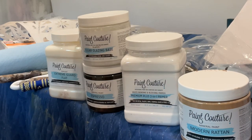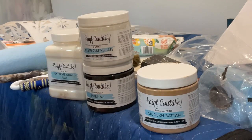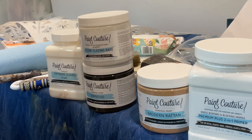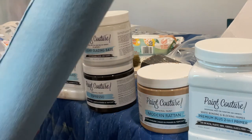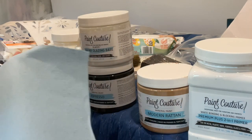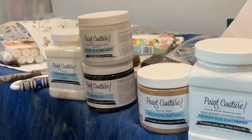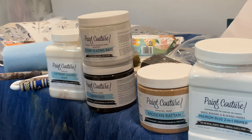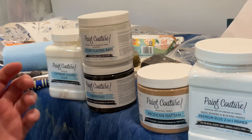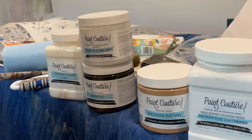I want to make sure you have all the tools you need prior to getting started. The first thing I used was Fresh Start cleaning powder from Paint Couture. I mix it in a spray bottle with warm water, spray it on my piece, and then use these blue shop towels — they're lint free and fabulous. You only need two or three of them for an entire piece. Wipe the whole piece down, scrub it if it's really dirty, then rinse with a 50/50 combo of vinegar water to remove all residual cleaning agent. Let it dry completely, usually overnight, then remove the hardware.